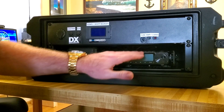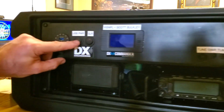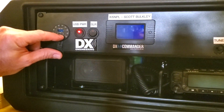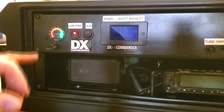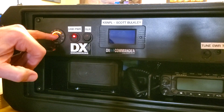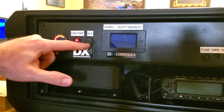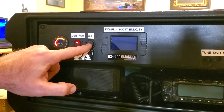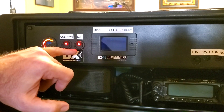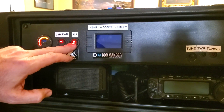Aside from the radio, I grabbed a USB power unit — it's got a battery meter on it with USB-C and USB 3.0. I also grabbed some toggle switches with LEDs on them. The second switch here powers the solar charge controller on a separate switch, so I don't have that on all the time — when it's plugged in it automatically turns on and starts draining the battery, so I can turn it on and off.